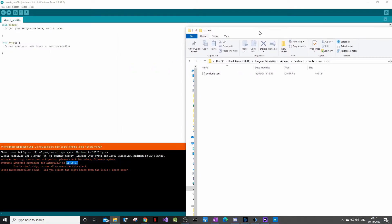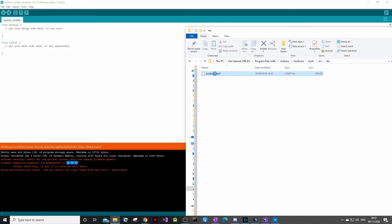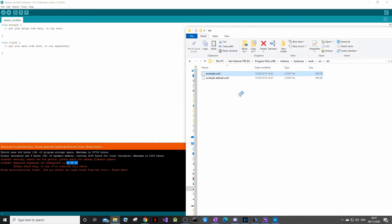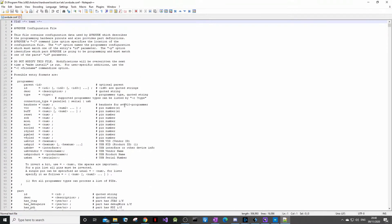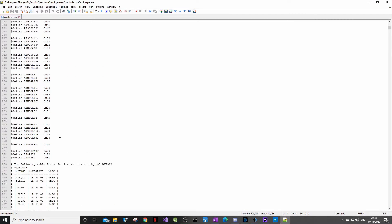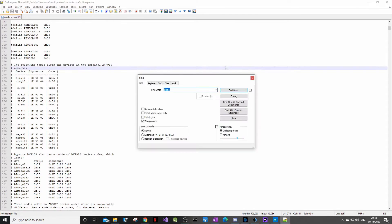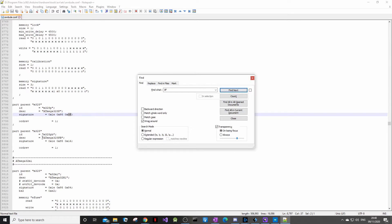What we're going to do is go into the Arduino files and tell it that the PB actually has that signature. What you want to do is find where your avrdude.conf file is — it's normally at C:/Program Files (x86)/Arduino/hardware/tools/avr/etc. I'll put the link below. First, make a copy of this file as a backup because what we change will affect behavior when going back to a plain P. Open it with Notepad++. You'll see all the chips and their signatures. Search for 1E 95 0F — and there you go, you can see the PB is actually 16.